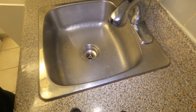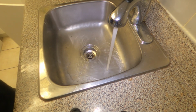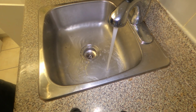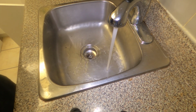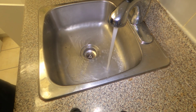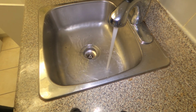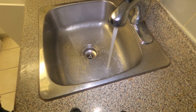So yeah, Gail, I think you're good. Are you going to be awake for a little while? Yeah. Okay, I'd like you to run your hot water, maybe 15, 20 minutes. No problem. If I broke any grease off in the drain, I wanted to make sure that it gets washed down and doesn't solidify again. And then you should be good. Put this on because I'm going back into the hallway. We'll see you next fall.